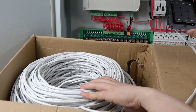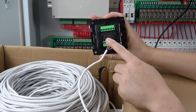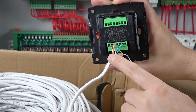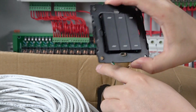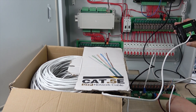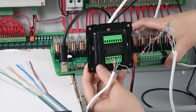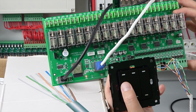I have installed 300 meters of network cable for testing the whole run, connected to my switch. This switch panel has six buttons wired with a seven-line cable — K1 to K6 and Kcom. The extra line is not needed. The cable on the side is connected to the E16S board input. You can see the 300-meter cable connects to the wall switch panel and the E16S works fine.